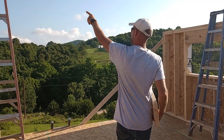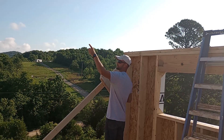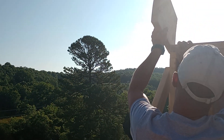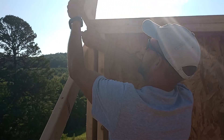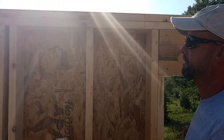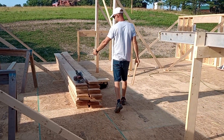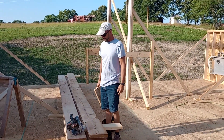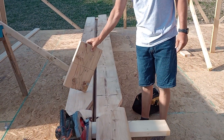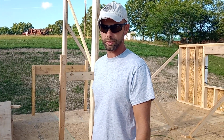We put it on our ridge board, pulled all our layouts — the rafter with the 4/12 on it. Then we set it on the brace right here and put it up just to where the tip meets the top of the wall, and we just essentially drew our scribe-to line for the bird's mouth. So that worked out real good. We got our template, and you want to use that one template for each one. You don't want to use this as a template for the next one — you want to stay consistent with the original so it doesn't get off as you go. So that's what we're doing today: putting up rafters.